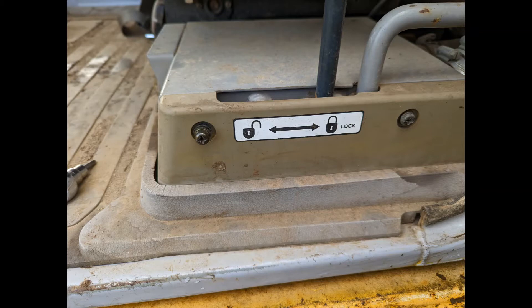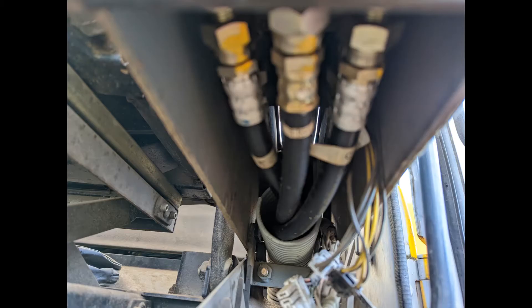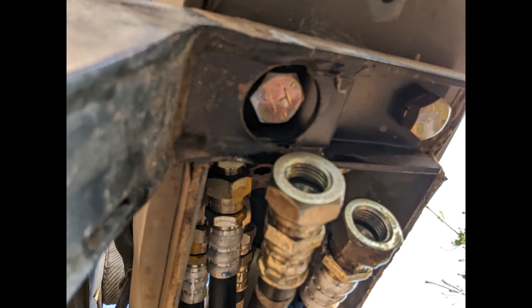Here's where the hose comes in and enters the cab. I took off this faceplate with the lock-unlock sign — you unscrew that and take off this metal box right here. I unbolted it with an 18-millimeter wrench. Then I took off the bottom portion, and you can see it's very cramped and tight in there. There are actually six hydraulic hoses in there, three behind, and there's no way to get a wrench onto them. So you have to dismantle the whole upper part of the armrest with the lever in order to get at these. Up around where the lever is, you can see this is the control lever itself. There are screws that hold it in if you lift up the plastic guard, and then underneath the screws there are bolts. You take those bolts off and you can drop that whole component down out of the very tight armrest, which allows you to get the hoses off.